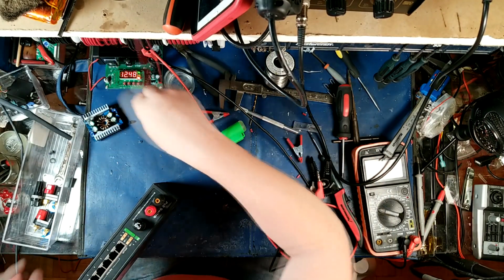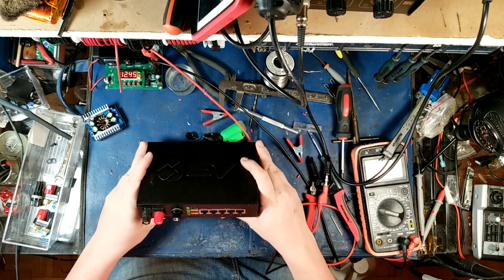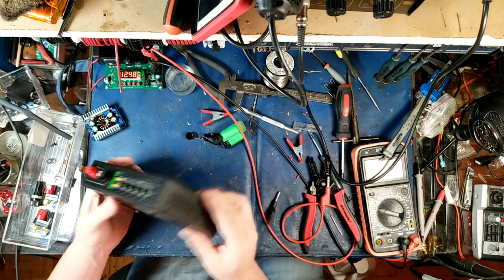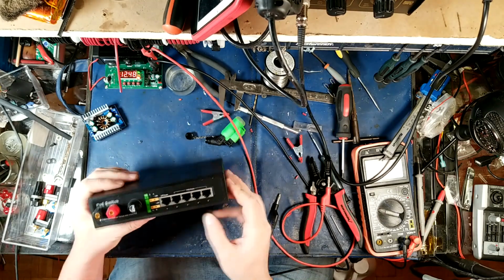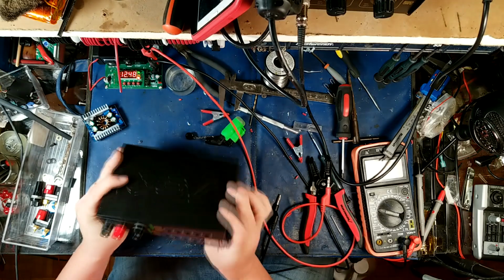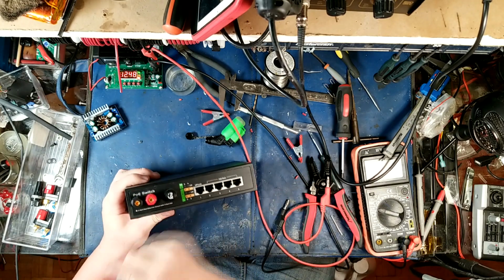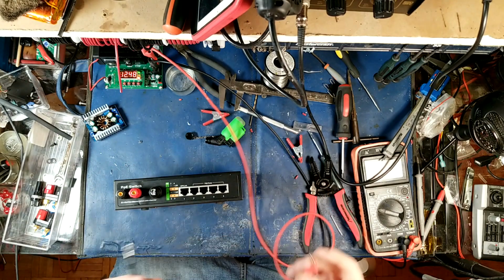So that is one switch down. This is an actual POE switch. Now you can see it from the front. Look, you got your fuse port, you've got your banana connectors. And so now I've got a handy little 48 volt portable switch, which will actually live on my workbench for when I need to program stuff and whatnot. But you can easily throw this in like a work truck or use it on a site or whatnot. The sticky's not very great right there, so I'll have to re-glue that, but other than that, that's a pretty decent modification, folks.